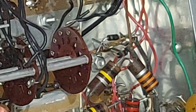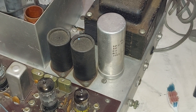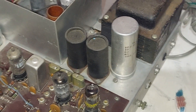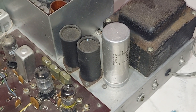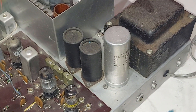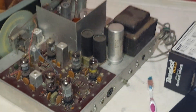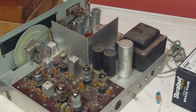One more thing to talk about. This type of power resistor here — that's a 5-watt — it's dead nuts on. The filter capacitors: what do you do with them? Do you restuff them? I do. If you don't restuff them, are you going to leave them on the chassis so it looks original, so that they could leak electrolyte all over and corrode everything? Or do you just take them out of the rig and leave three ugly holes there? I restuff them. I cut the cans apart and put the new electrolytics into the cans. That's what I do.